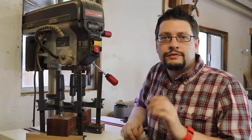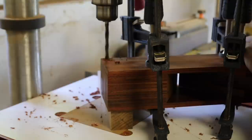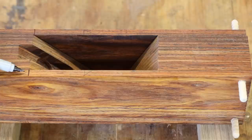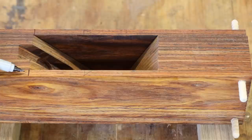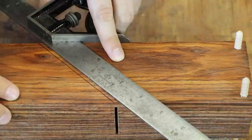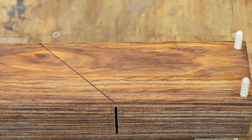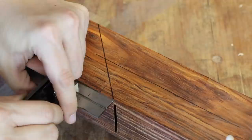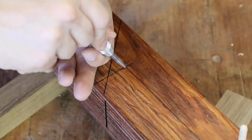Check the sole. Now here at the drill press, I'm going to use a quarter-inch bit to drill four holes on each side for these quarter-inch dowels that are going to be the locator pins for the body to the sides. Let's take a square and bring over a line that shows us where the 45-degree angle starts and ends here on the very top. I want that 45-degree angle to continue down. Then take a square, set it at an inch and a half, draw a line all the way across, and what we're looking for is five-eighths of an inch in — that's where we're going to draw our quarter-inch hole.